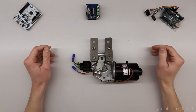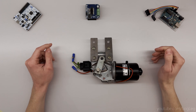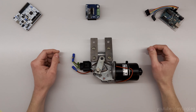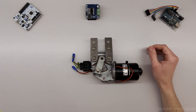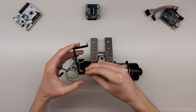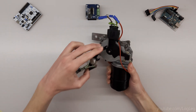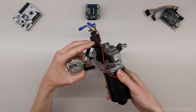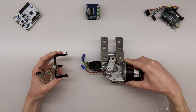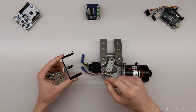While I'm rewriting the software from the Arduino to the STM, I also wanted to change something on the servo motors themselves. At first, I used a potentiometer to determine the position of the axle of the motor. I used this bracket here, and as you can see, the connecting axle snapped — it actually mounted like this. And it was kind of flimsy, so I wanted to get rid of it. Also it wasn't centered, so that's why it broke so much.